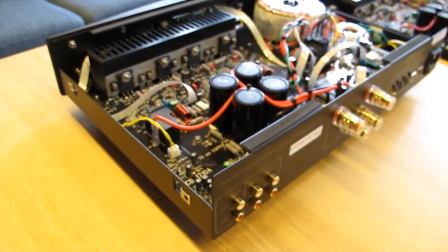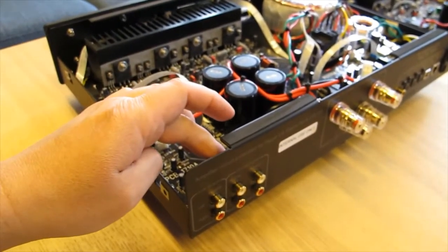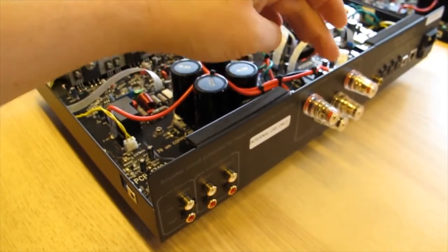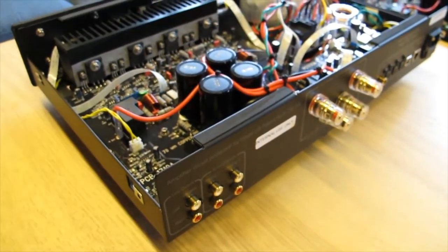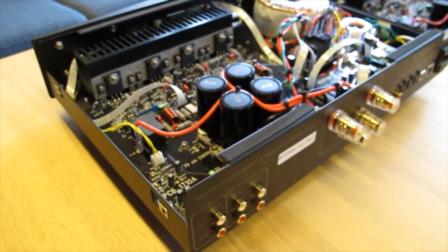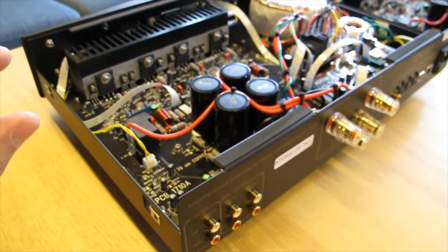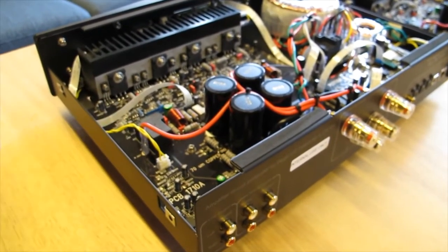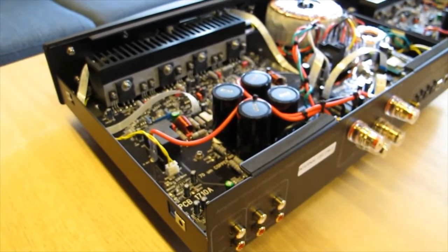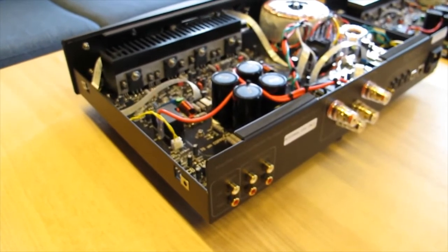Sound Engine 2 is really an analog computer, and the analog computer in this case takes a sample of the signal that's going into the amplifier and compares it to the signal that's going out into the loudspeakers. By comparing those two, it can subtract the difference. The difference would be the extra sounds that are generated inside the amplifier circuitry and really being distortion. That's a name for distortion. So it detects the distortion and plays it back in reverse phase. So it dynamically cancels out the distortion and extra sounds that are created inside the amplifier. This very effectively leaves you with almost a mirror image of the signal you're putting in.